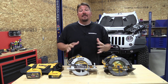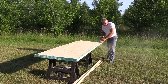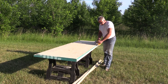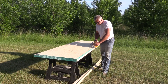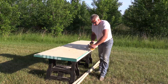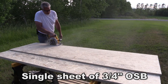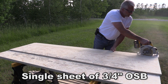While they look the same, they definitely do not have the same power. Because these two saws are so similar, it gives you an idea that maybe the 20 volt max saw will be just about as powerful as the FlexVolt saw. But we found that not to be the case, especially when we put it to a test with three pieces of three quarter inch OSB stacked on top of each other. In most of our other cuts the 20 volt max saw was plenty powerful enough, but it's just not going to cut at its maximum capacity for long periods of time without a little bit of a struggle.